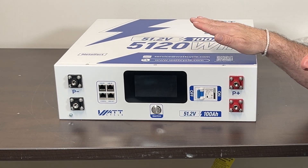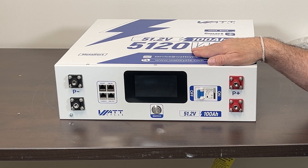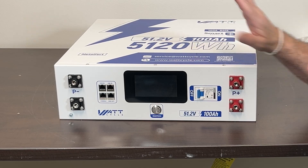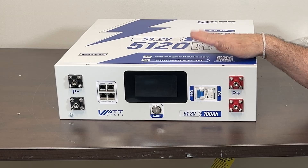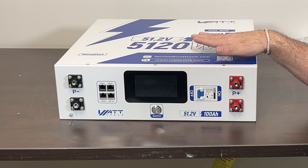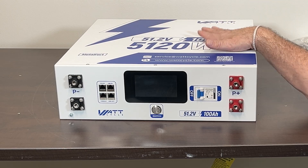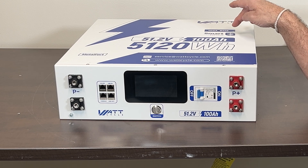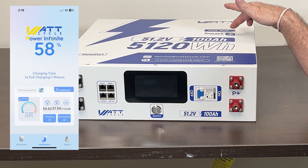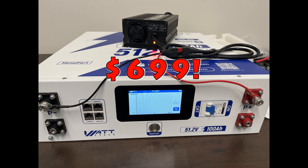My next steps are to do a full capacity test. I'll get it fully charged and run a 0.2C rate test. When Will Prowse tested the V1 he got 102.7 and 102.3 amp-hours, so I'll repeat that test. He also did a 1C rate test which I don't have the capability to do. I really like the color scheme of this battery. I also didn't mention it has a Bluetooth app for the BMS, which I'll demonstrate in the full video. The best part is the price — it's currently on sale for $699, making it the best price I've seen for a server rack battery at this quality level.